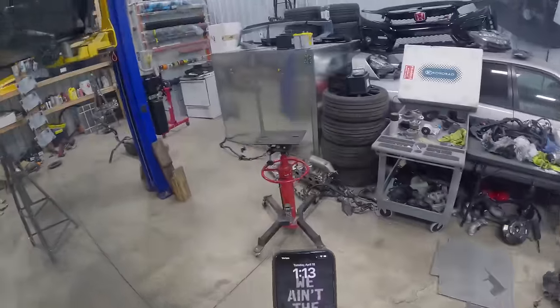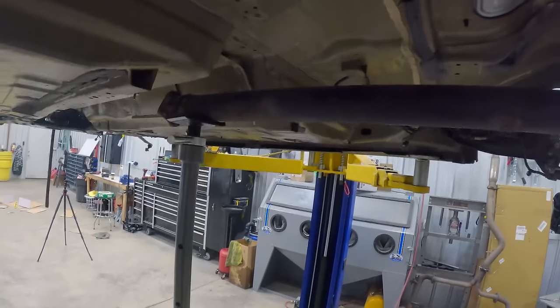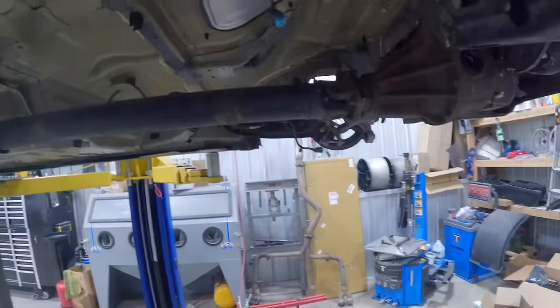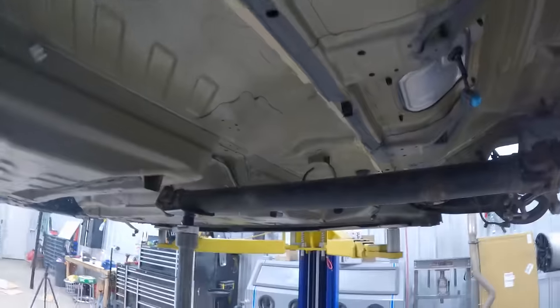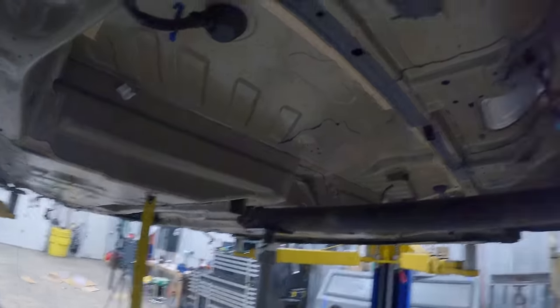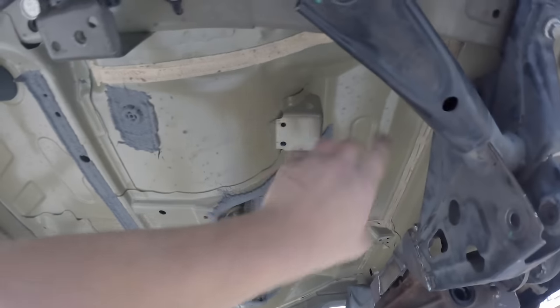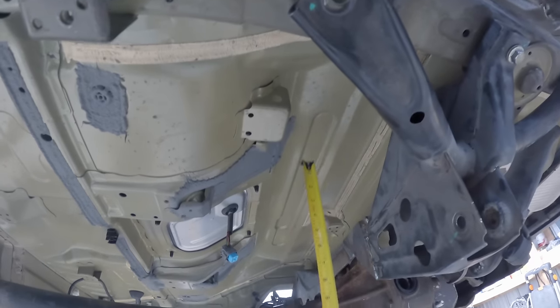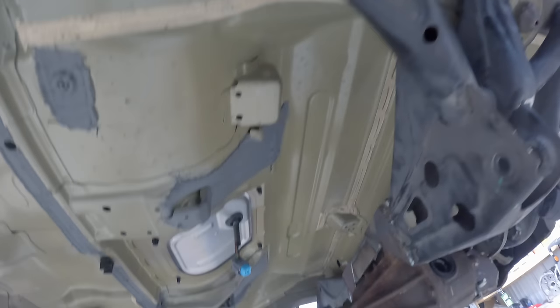Damn. All right, so I'm kind of rethinking my plans with this thing. We need 8 inches of depth total to fit. Of course, we have a fuel level sender, and then we have some other Radium stuff I'll show you guys later on. We need 8 inches of depth. If we went 8 inches from this right here, the tank is gonna hang down like 2 inches below this guy here, which of course I don't want. So what we might have to do is come even further back, and being that this curves up like that, if we had our Radium products back here, it wouldn't be a big deal. We'd have all the space in the world. So I'm gonna have to make this longer. Oh yeah, we have like 11 inches back there. Of course, I'd have to pop that mount off. That thing's kind of in the way, but easy enough.